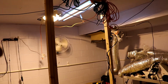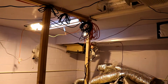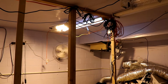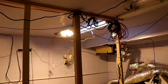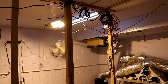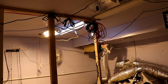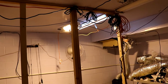And there is a vent about that size underneath it that goes directly to the roof. Inside of that box is the can filter, completely sealed with about 7 mil plastic to the roof, with tape and all that. Then I put that box there and also sealed that, just for extra support. If I do get a leak somehow underneath with the plastic, it'll have that extra box sealed up to hold the air before it can get up and out that vent.